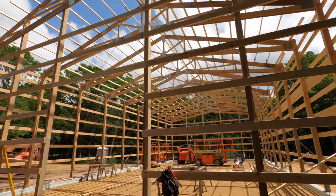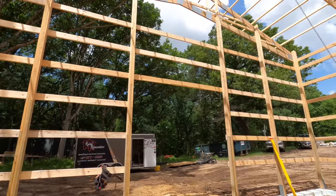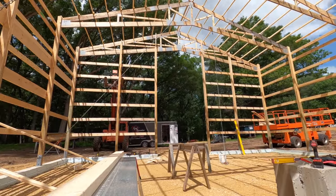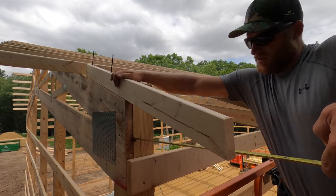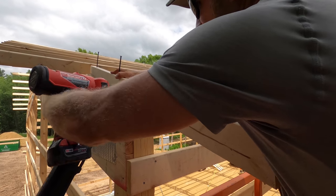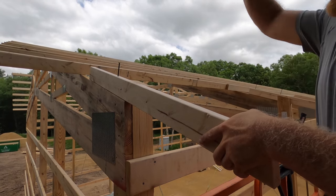Now that all the walls are up you can really start to get a picture of what this building's going to look like. The shape will obviously change when we start adding the porches, overhangs, and frame out windows, but that all takes time. This is what I always call the instant gratification phase — it goes pretty quickly with a lot of physical hard work. Now we have to start doing our detail work: we're going to get set up to do our overhangs, cut a two-by-four down to size to give us our two-foot overhang, install our sub fascia, and other miscellaneous framing to complete the roof structure so we can start putting on our sheathing.